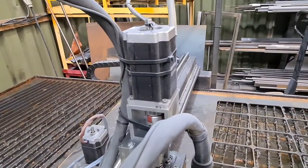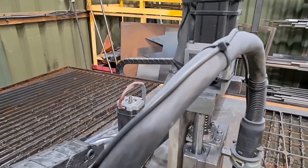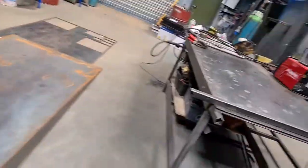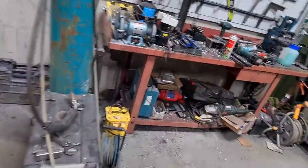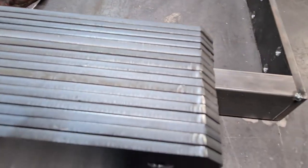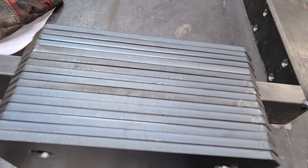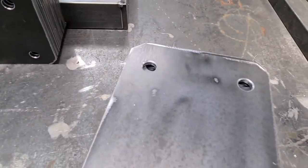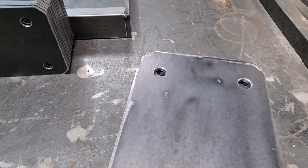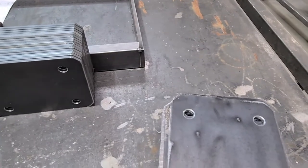So it's hardly surprising when it's chucking around a little lumpy motor like that on top, got the cable as well which at times at full stretch is a bit stretched. So yeah, that was the problem. And the result of that cut once we finished it was this — no wobble. All these little marks are lead-in lead-out marks, but nothing — all the cuts are perfect. It was just that aluminium flexing. I had a bet with one of the guys here that it wasn't that — lost a beer, but there we go.